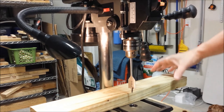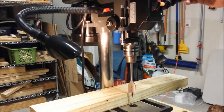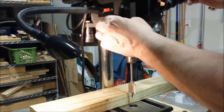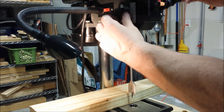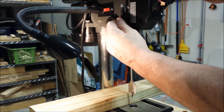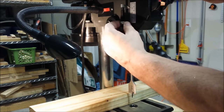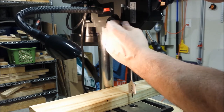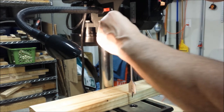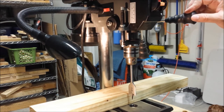The other thing you might want to do is drill to a certain depth rather than punching through. Again, take it down to what you think the approximate depth is, then take both of these nuts and bring them down. It takes a while because it's a long ways to go. What that does is stop the drill at a certain depth — probably about halfway through your workpiece.